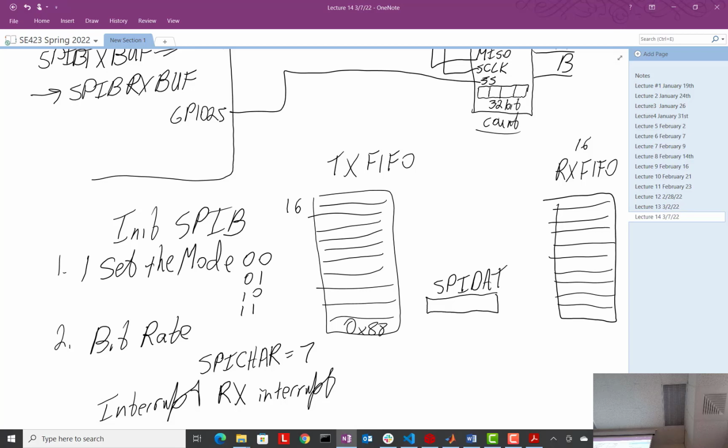If I didn't have a FIFO, I'd write one thing and wait till it's done transmitting, and then write another thing. Now, if I had to write 20 things across, I'd be in trouble, wouldn't I? Because I couldn't write 20 things, boom, boom, boom, into the FIFO, because it would overflow the FIFO, wouldn't it? There's only 16 elements on the FIFO. Well, good news. In this case, all I needed to write was 2 things, didn't I? So I could write hex 88, and then hex 83 gets put in the next place in the FIFO. Okay? All right.